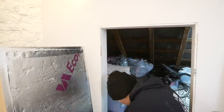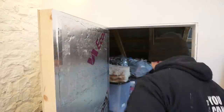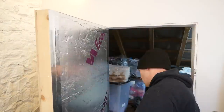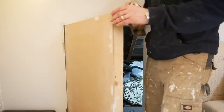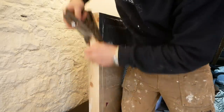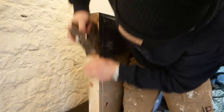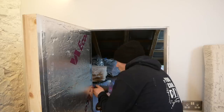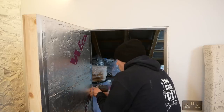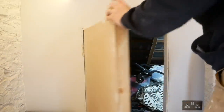Now we're dealing with a 60mm thick door here, so significantly thicker than a normal interior door. For that reason, as it closes, you need to work back that leading edge on a slight angle — that just means it will clear the lining as it closes and you won't have to have a huge gap all the way around the door. I was shooting for a 2–3mm gap here, and like I said there's a bit of variation in the lining, but we pretty much got there. Then by tightening in those last few screws on the hinges, that just snugs it across by another millimetre or so.